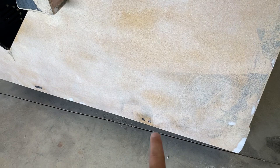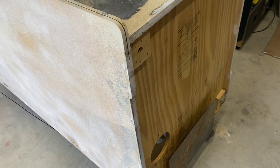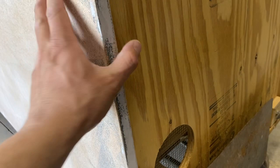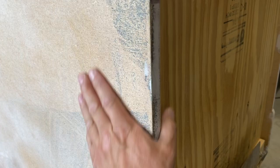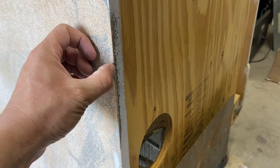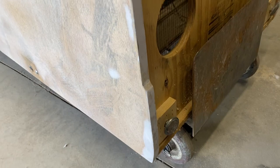I did run lacquer thinner again on the side to get the adhesive off. Regarding the bottom: remember that little bit of curve and that divot — it's very important to me to keep the official Konami cabinet shape. Because it was getting chewed up, I ended up skim coating body filler on the bottom and sanded it as far as I could until I mostly saw wood coming through. That allowed me to strengthen it and keep it from fraying, and also preserve a nice edge for if I ever put a decal on this — right now I'm just going to paint it black.